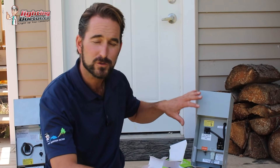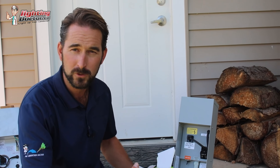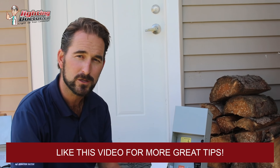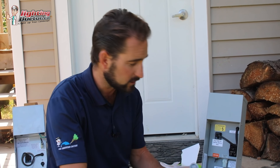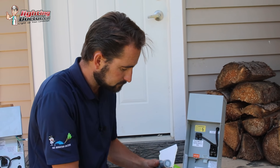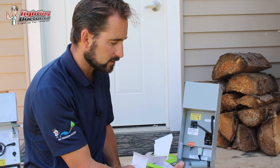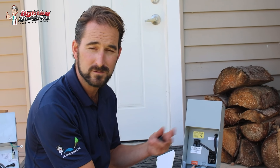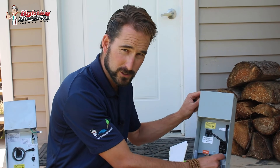One of the last steps is controlling your transformer. Our transformer has a simple on-off switch, but you don't want to be coming out in the middle of the night flicking it on and off. Two options. First, a simple option: a photocell. I'm not a huge fan because they tend to fail, but it reads the sunlight and turns your lights on and off at dusk and dawn — super easy to plug into your transformer. There's a little cutout you leave exposed so it can read the sun. The downside is you can't put your transformer inside, and you have to be careful it's not in too shaded a spot.